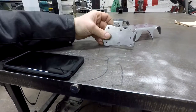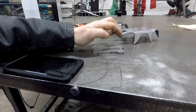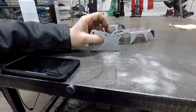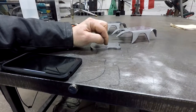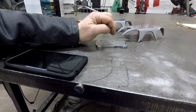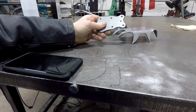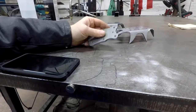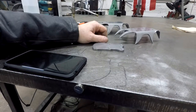Last year I just dimpled and pierced them on the plasma, which I found is not very accurate — it has a plus or minus of probably a millimeter, millimeter and a half. Which means when you add a drill bit in there and you start drilling down, it wanders a little bit on that dimple that's not quite perfect, because plasma kind of work hardens the piece right in that area. It's not the best way to do it — it's a quick, dirty way to get a prototype done. But if you've got to make 10 or 20 of these things, it'd be a lot nicer if you could have it nailed the first time when it's drilled out on the CNC mill.